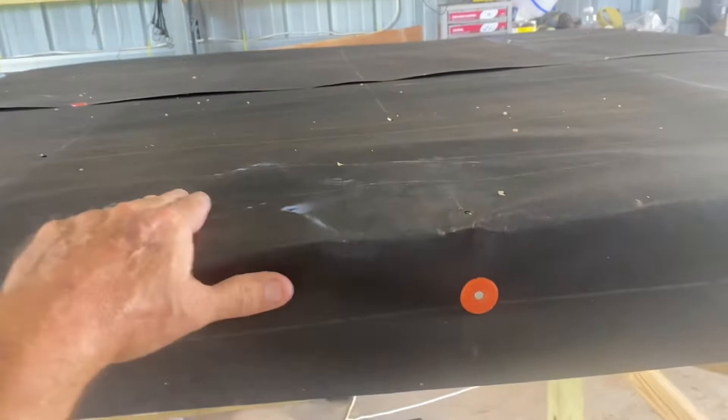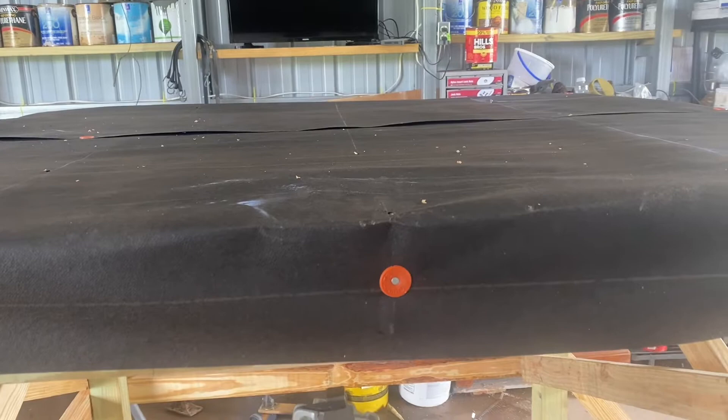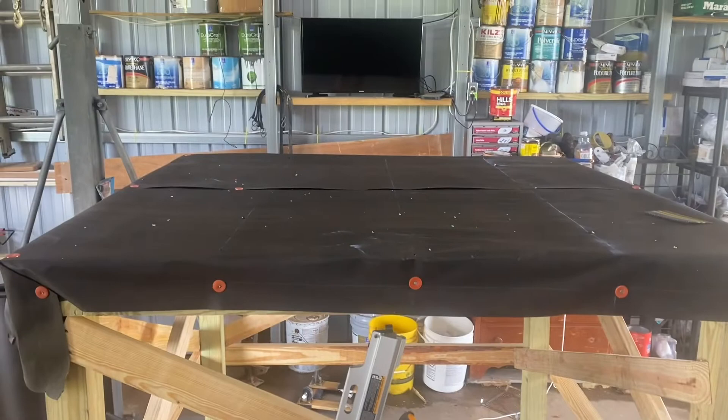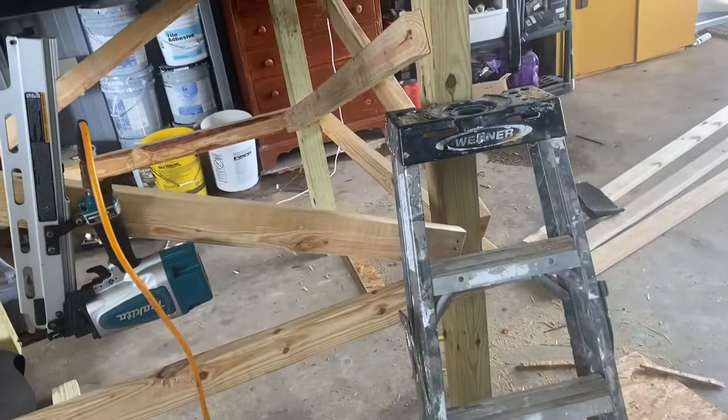Okay, that's the floor — sandwiched between one inch of OSB, felt paper top and bottom. I'm putting the stand out on the side to see how she looks, and we'll figure out the front, the back, and all that good stuff. It's all nailed; I'm gonna come back and put wood screws through all these joints just to be safe since it's gonna be in the woods.